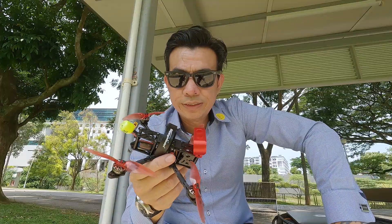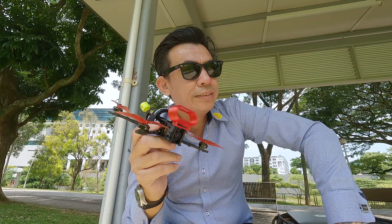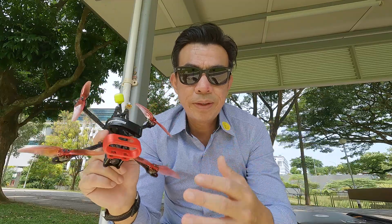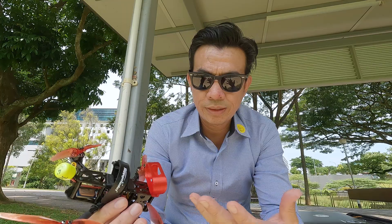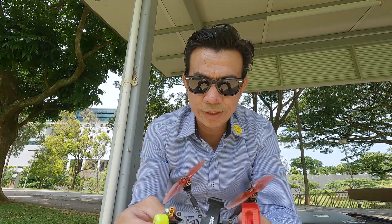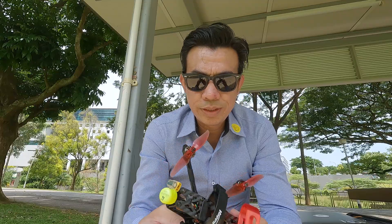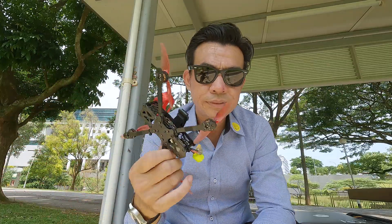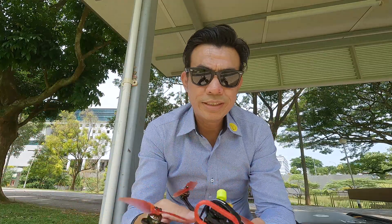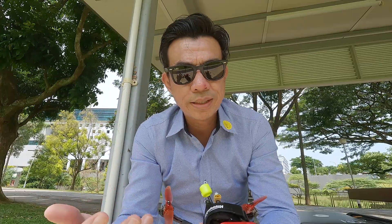The Pancake flight controller is an AIO with the VTX and receiver all built in, except for the ESC. It really depends on what you want to build — you could build a 5-inch with this, but with the F4 board, you'd probably choose an F7 instead for that. I would use this for a micro; it makes more sense, easier to carry around. That's one of the reasons I decided to build this 4-inch micro. There's also an extra copper pad for a buzzer.